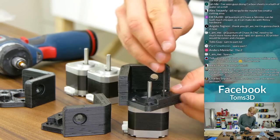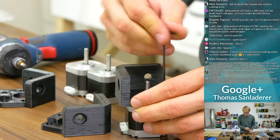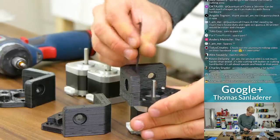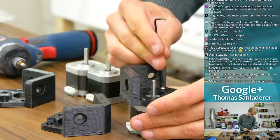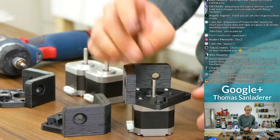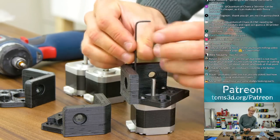Printing parts could be a bit better. Yeah, I mean, you can tell they're printed fast, they're printed hot, maybe even with a bit larger nozzle, but definitely huge layer heights. Print quality, I mean, it's not an issue as long as stuff fits together, as long as these holes are maybe reamed out. But yeah, print quality is pretty poor in these parts. It's not that it matters, as long as they are strong. But yeah, could be nicer.